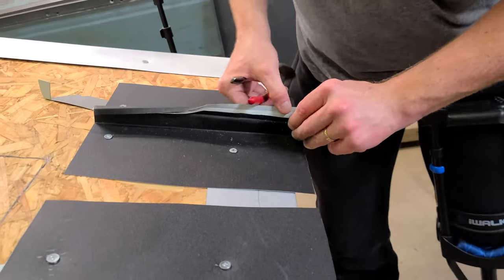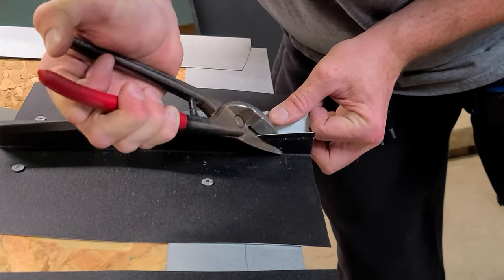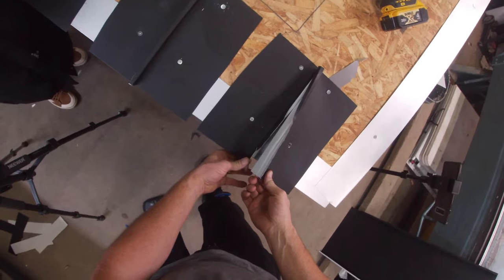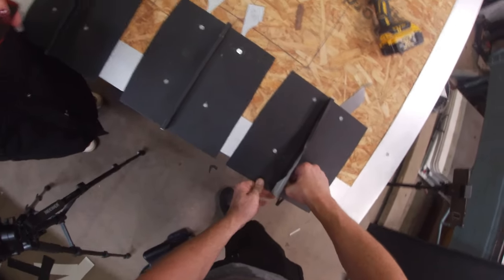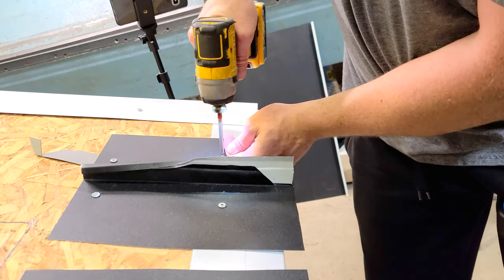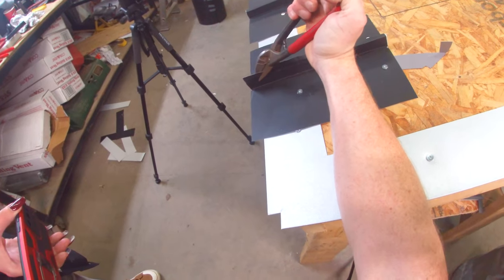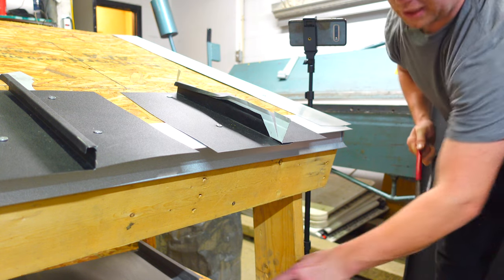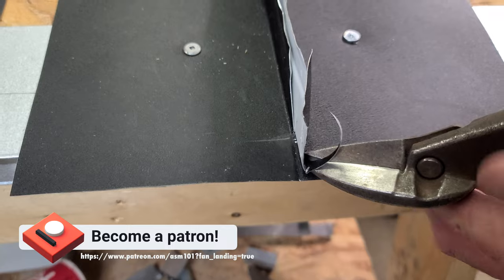This one I like to spread them apart a bit. This one just gets cut straight down. On the roof it gets folded right under — this would be done first before the panel goes on, but for demonstration purposes you just lift that panel up, put it under, and then pop it back. Just going to cut right to the lines that I drew with the jig, and then we're going to put that little radius that I was talking about earlier.